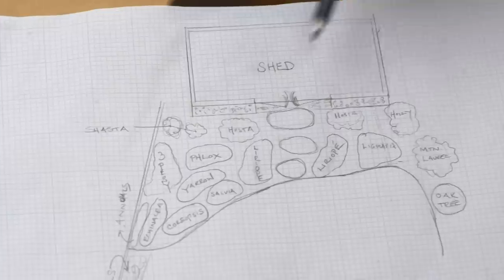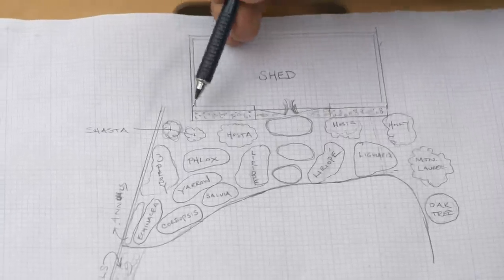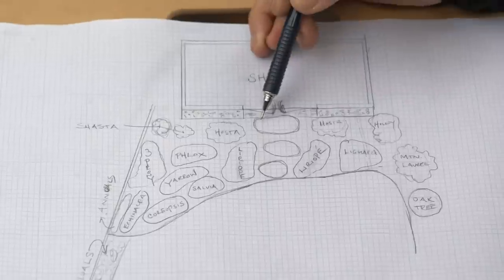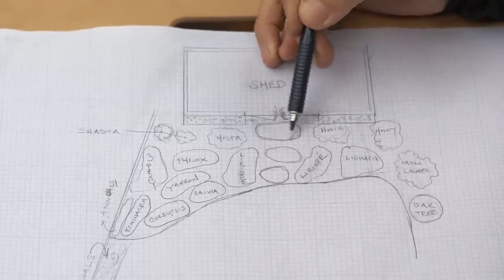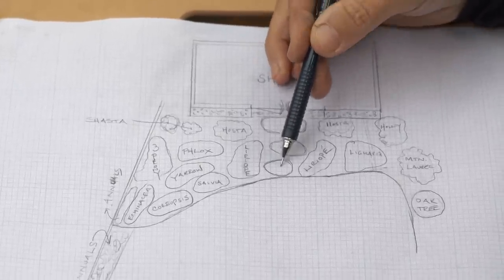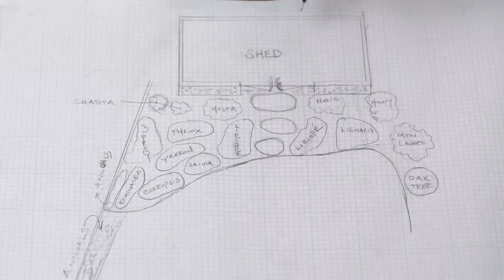So here's the plan I came up with. I'd like to start with the shed — here's the drip edge, come out 12 inches. That's going to fix any water backsplashing up and rotting your wood. New England stepping stones — I picked a native New England stone. It's a Goshen stone, a durable stone. You're going to be able to get lawnmowers and snowblowers in and out, creating perfect access while maintaining a natural vibe.